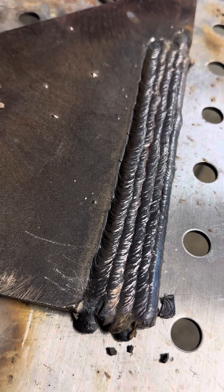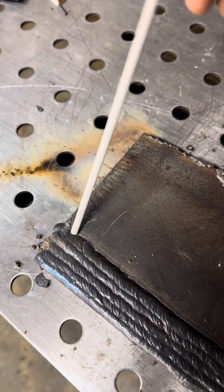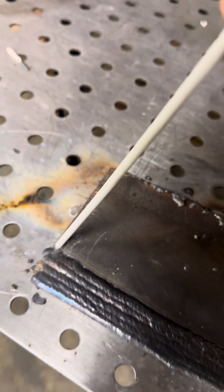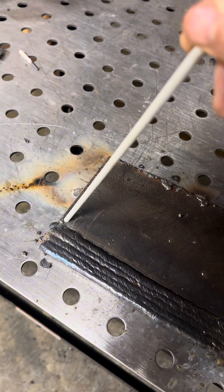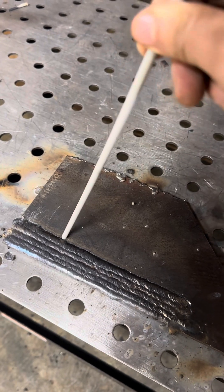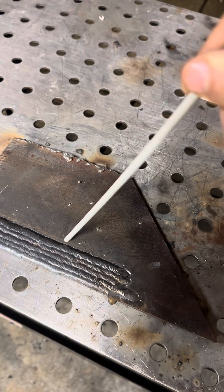Went ahead and ran a couple. You don't want to point the rod directly at the side of the weld because you're going to get more than 50% coverage and you're probably gonna have undercut. So you just want to start a little bit away from the weld, and right when you strike up, you're going to see how fat your puddle is going to be. Once you get that 50% coverage mark, that's when you want to start moving. Keep everything the same - the same rod angle, everything exactly the same from start to finish.